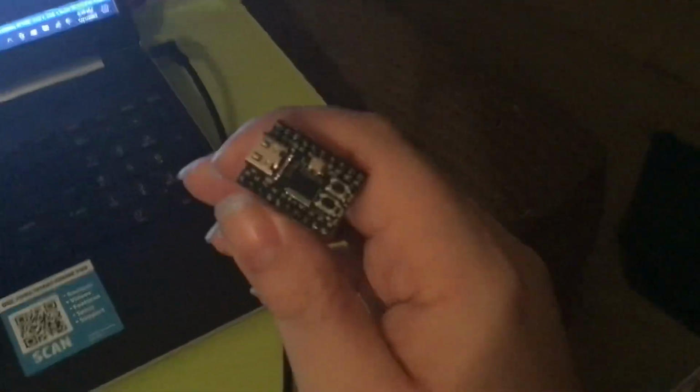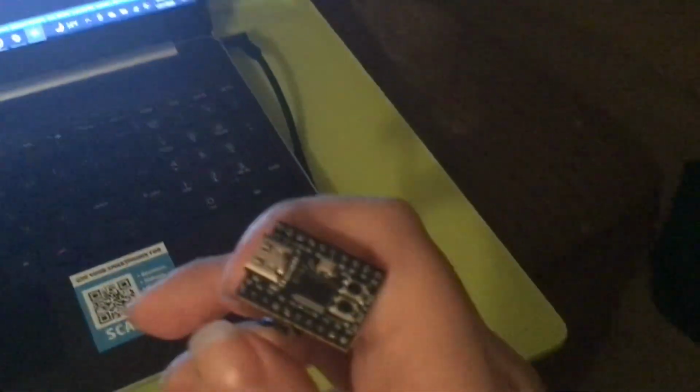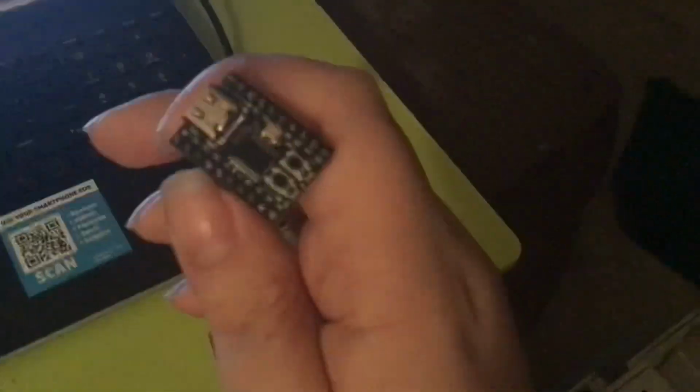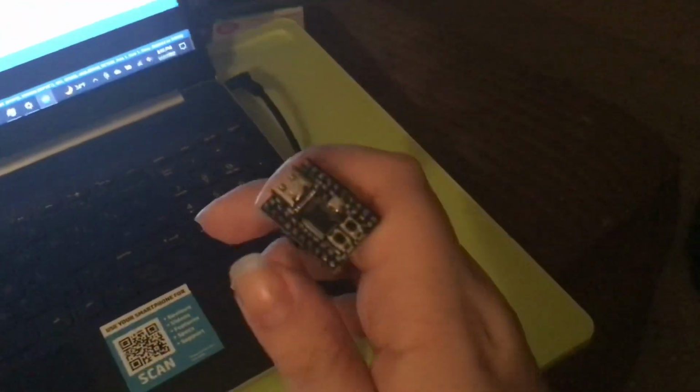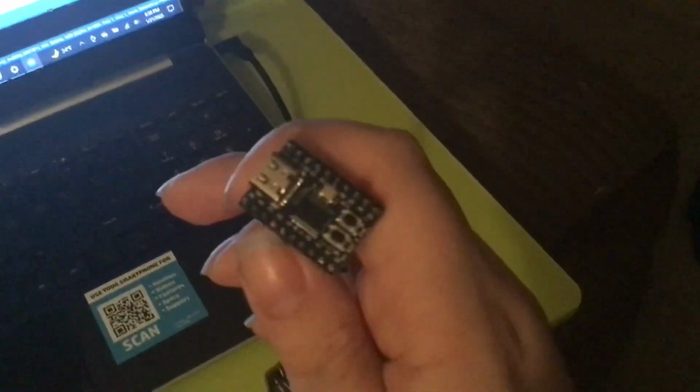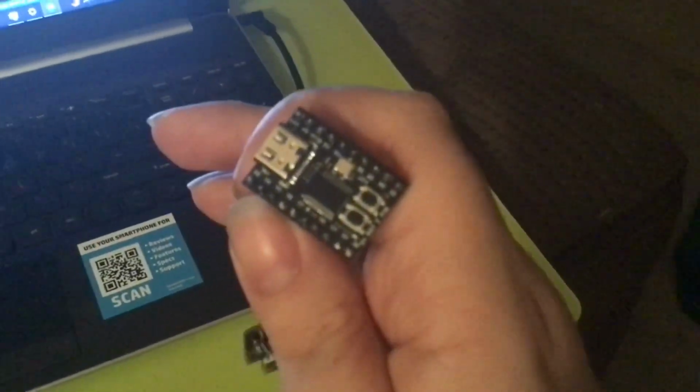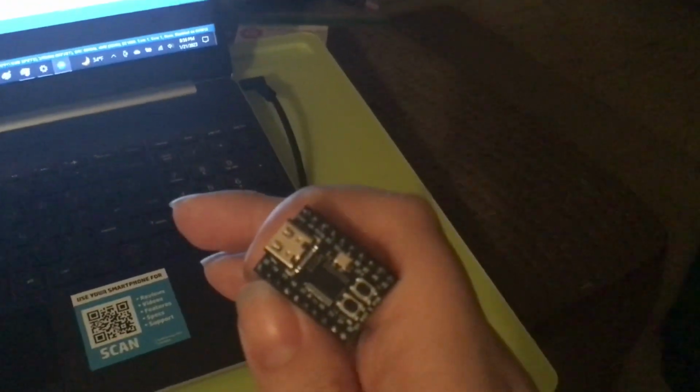For example, the Raspberry Pi Pico and a bunch of STM32 boards, and maybe some Atmel ARM boards. All these controllers have serial interfaces like SPI, I2C, UART. They may have multiple instances of each, but each interface has multiple sets of pins that connect to each port, and only one of those sets seems to work. None of the other ones do, which I don't like. So I have to plug a bunch of wires in, if you know the pinout, to find the right one that actually functions with the interface. This controller, and most if not all ARM-based processors, have that same issue.